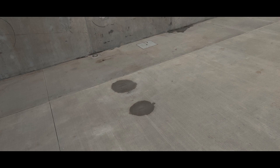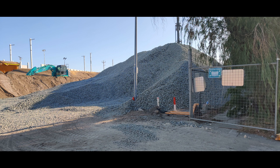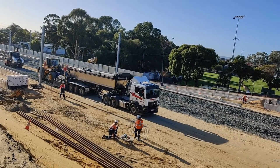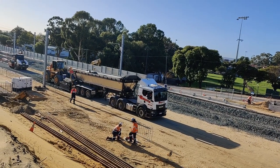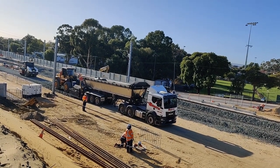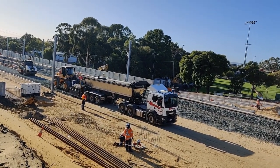So the next thing we have is a large pile of ballast. Once your ground's compacted you're going to spread some ballast over the top of it. There were a few different crews working on this job: one was using a loader basically to spread a layer of ballast down, and the other crew had this really cool system with a truck and a loader with an attachment on the front of it. It basically pushes the truck along and spreads a layer of ballast on the ground — the truck driver just has to follow the survey marks.